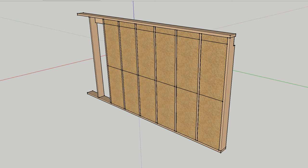On top of the insulation I want to put a plaster wall. The plasterboard I buy is adapted to CC 60 and is 120 centimeters wide. Since 60 plus 60 is 120, the plasterboard fits perfectly on my studs.